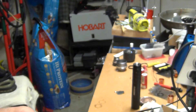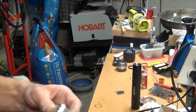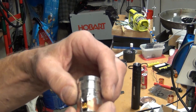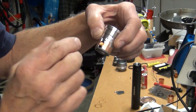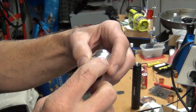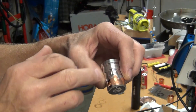I can measure it and let you know — it's 15 millimeters. The driver is a 26 millimeter driver. First you cut it to the 15 millimeter size, then you cut it so you can open it. After you cut it, you stretch it open a little bit so it will fit exactly to the driver and fit almost perfectly to this part of the flashlight.